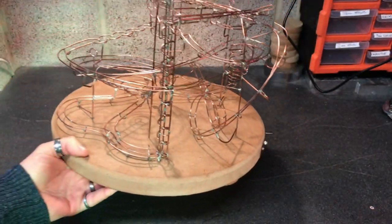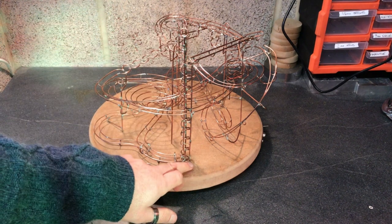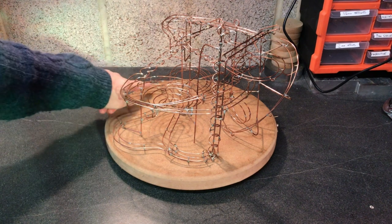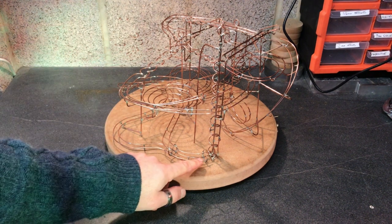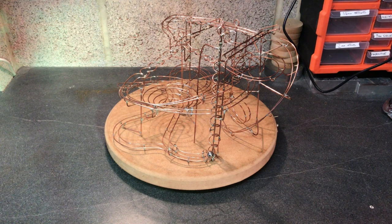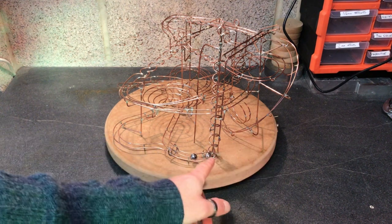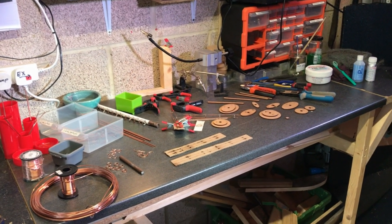Only the center axis pokes through a very small hole in the baseboard — that's the look I was going for. One reason I wanted it so sleek is to maximize the height of ball lift, with the balls sitting really low on the baseboard when collected. The biggest mistake I made was routing the ball run into the ball lift too low too soon, so the ball arrives slowly, bounces back out, and the motorized lift sometimes fails to pick it up.